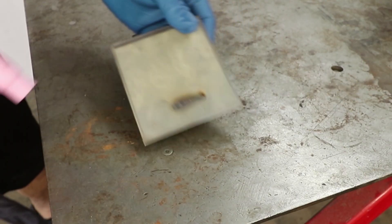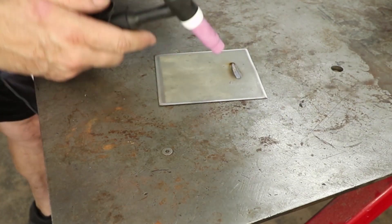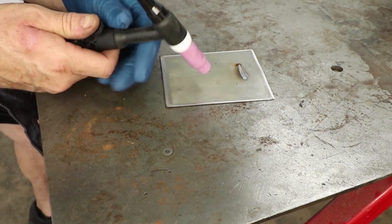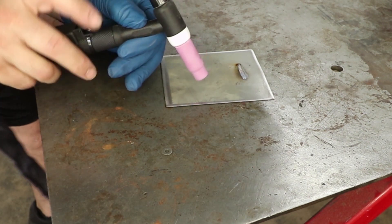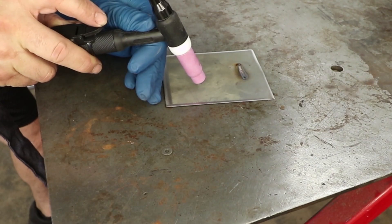No filler. This is high-frequency start, so you don't need to lift. You basically just get it to the surface. I like to keep the tungsten very close, and then it's just hit the trigger.